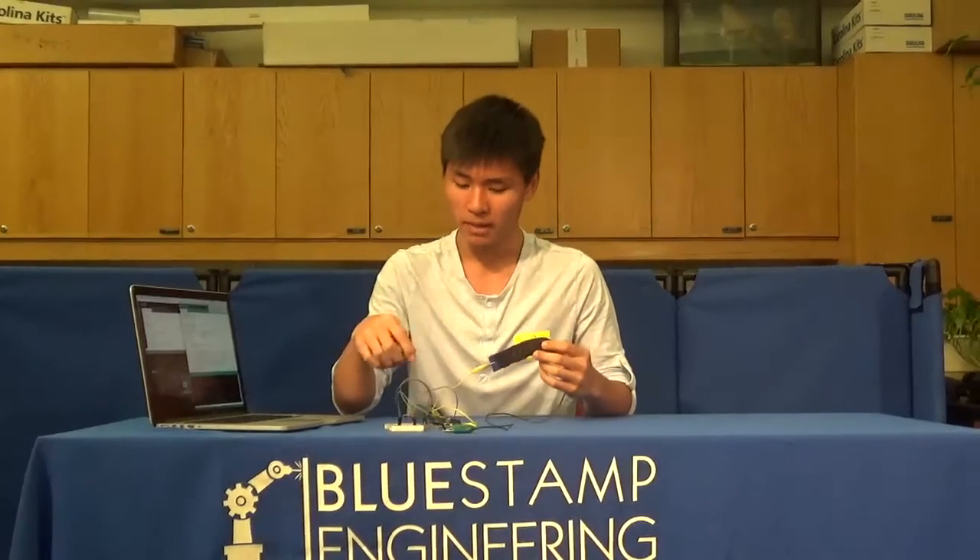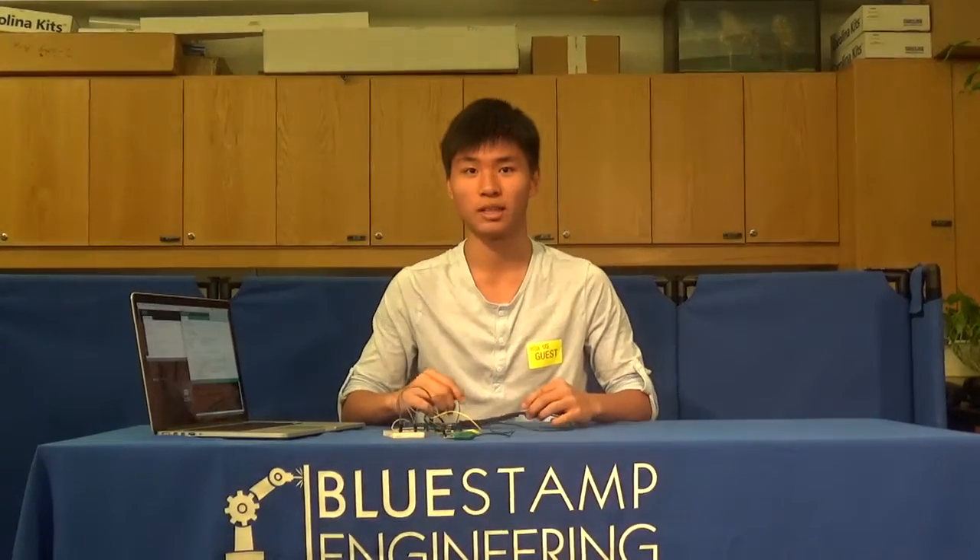As for the wiring, I created essentially a voltage divider, because the bend sensor acts as one resistor. The voltage afterwards is then measured and picked up by the Arduino, and then there's another resistor that I put in after that — which is important to know for a later problem I came across. As for the programming, I modified an Arduino code I found online to translate the resistance coming through the bend sensor and turn it into an angle that could be analyzed.